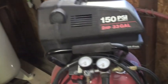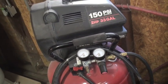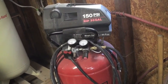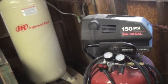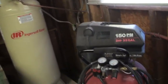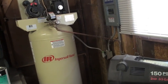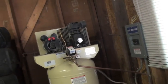Anyway, that's what I got. Check reviews online and see what would be good for you. If you barely have any money, I'd recommend just getting something at least in the 30-gallon range with a higher CFM rating on it. You got to do what you got to do. But if you have the money and you can go get a bigger one that's 220 volts — this one's actually 110 down here — it's definitely worth it. Go pick one up. Well, that's it. I hope this helped. Check you guys later.